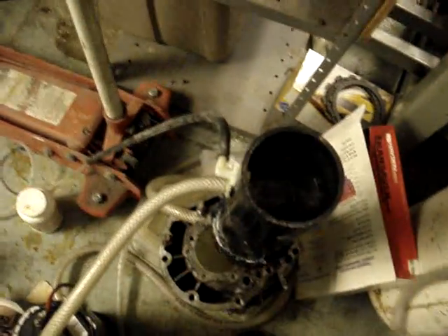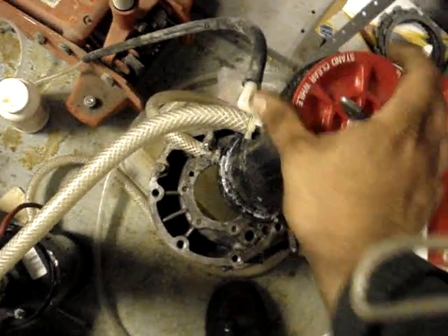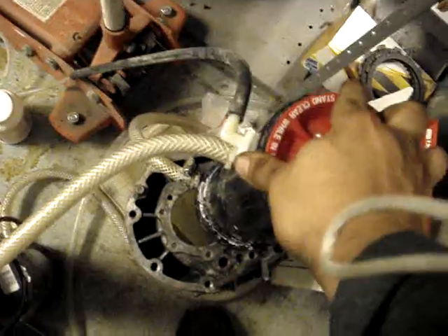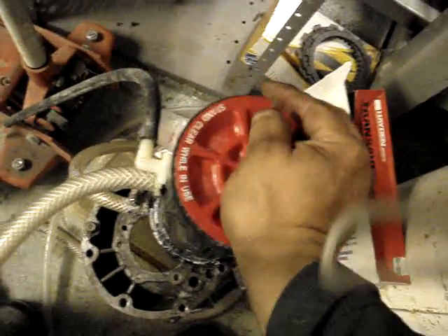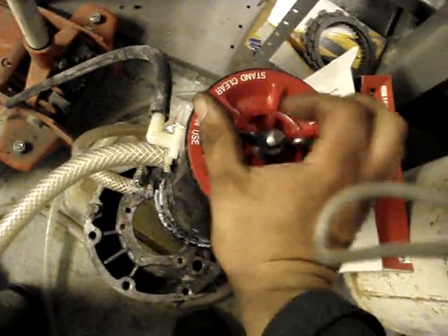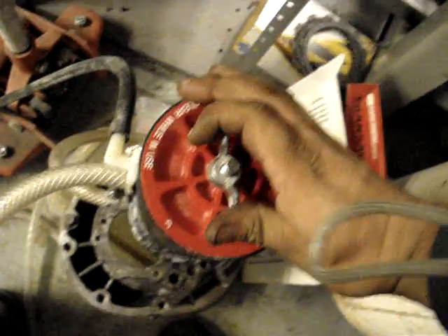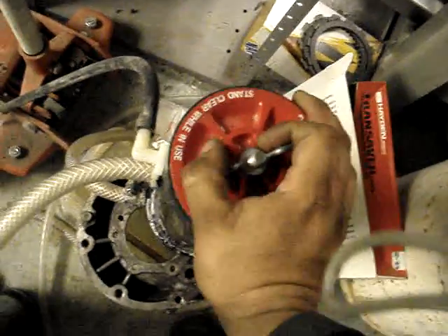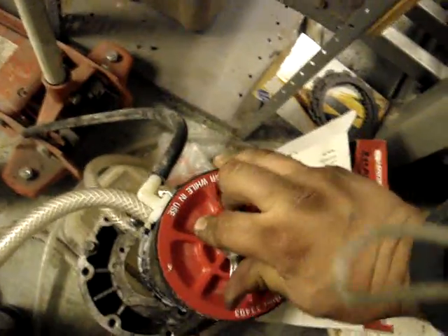Then the antifreeze solution will go through a big transmission cooler, and it will need a pump — one to two gallons an hour should be sufficient, just a little circulation pump, something about $40. It'll go through a 28,000 GVW transmission cooler, since it's just distilled water and coolant with no corrosion, and draw the heat away from my cell.